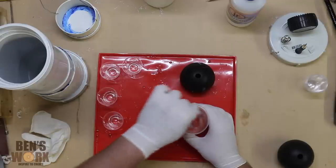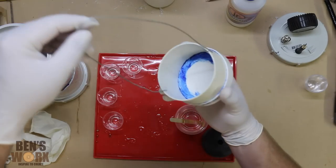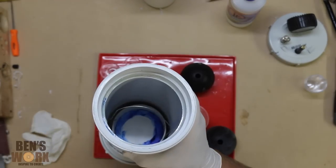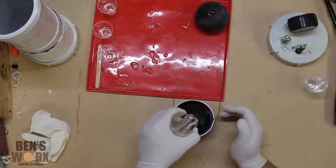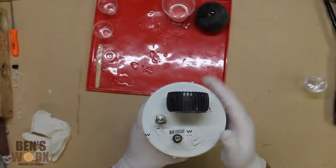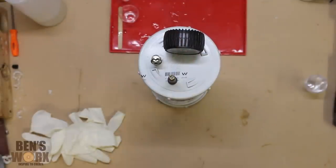Now it's time to test it out — I'm going to be casting two round balls using some ice silicon molds. I've also made this little caddy just so I can get my castings in and out of the pot. For this experiment I'll be using the same resin: I'll cast one ball and leave it outside, and the second ball I'll put in the pot. I'm going to pressurize to 18 psi and run it at low pressure to see what we get.